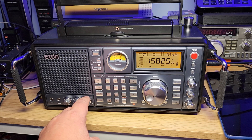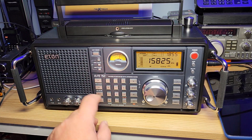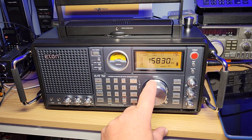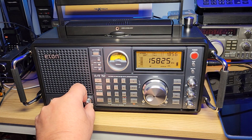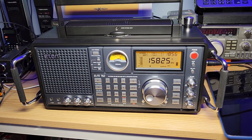On single sideband, if you put the bandwidth filter to narrow, the slope is actually pretty good — it looks more like what the Tecsun does. So it is a major flaw. I'm sorry, but they're all like this. If you haven't noticed, maybe you're not listening to signals the way I do. If you have a lot of signals close together, you'll see that this radio can't cope — you're always forced into the narrow filter. It's sad, but that's the way it is.